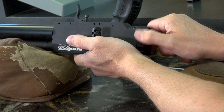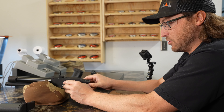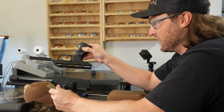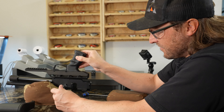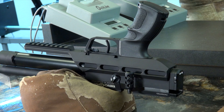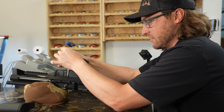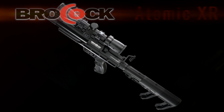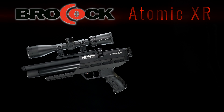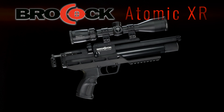I'm going to put the hammer spring in here, put this right in here — it doesn't actually push too hard, so you don't have to push it down too hard. This just acts as a cap when it's on but not threaded. Now at this point it's just basically reassembly — I'll start with those two three millimeter screws. Now it's back together. I like to double check that the gun can still cock, just make sure that the hammer spring isn't bound and there isn't anything in there that's going to prevent any function — and there isn't on this one. Give the adjuster a little run, make sure there's no friction or anything that feels tight in there. This one feels great, it goes both ways.